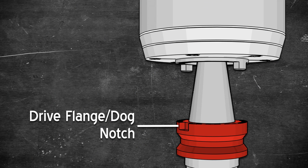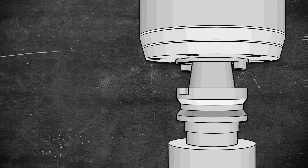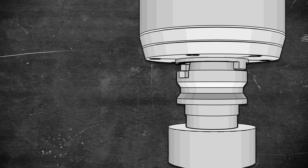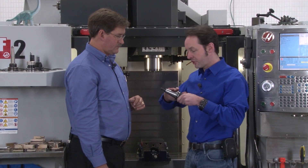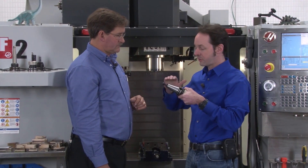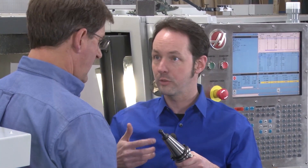There are also two drive dogs, or drive flanges, and these match slots on the spindle — that's what drives it. So if you put the tool in with the dogs misaligned front-to-back versus left-to-right, it won't go in. Given that this surface looks very precision, smooth, and ground, it's very important to not have chips, crud, rust, or dirt on it. This has to be super clean.